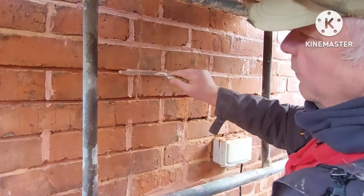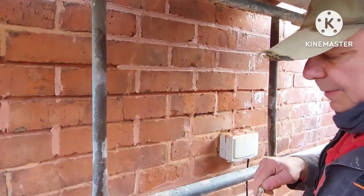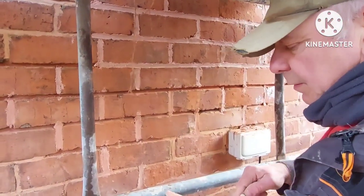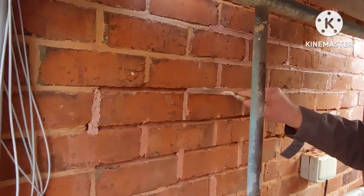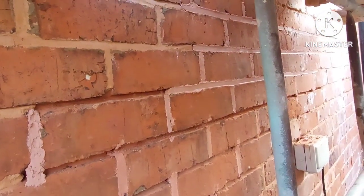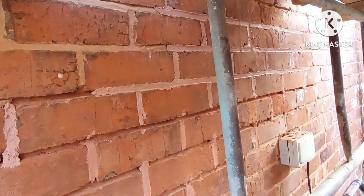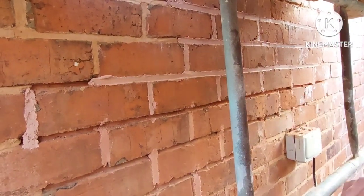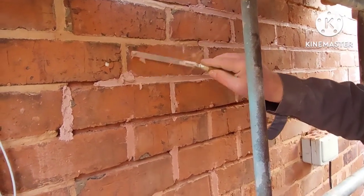If you were doing stone — pointing rough cut stone — you'd be using a grit sand, and you'd possibly put a few flecks of granite chipping or something in there to give it body. For really thick deep bits you put in what we call pins — little bits of stone — placed in first on the deep bits. Then the procedure is the same as before whether it's on brick or stone: let it set in a bit, then give it a good whacking with the churning brush to compact it all, and once compacted give it a tickle with your stick.